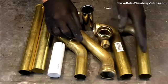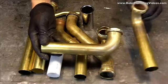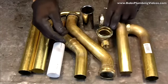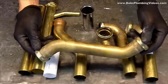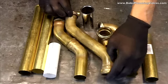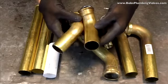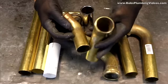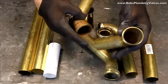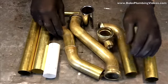There are several different methods depending upon the distance you have to go from the strainer to the p-trap. You may use a couple of 90s — these can be cut. You may also use a waste offset. You don't use it like this, although I've seen people use it that way. You do have to cut these. Depending upon where you cut them, you can get your distances pretty far. You can cut this short or leave it long depending on the distances under your sink.